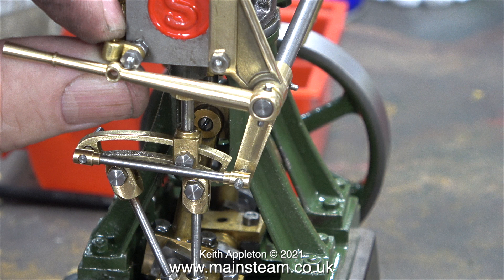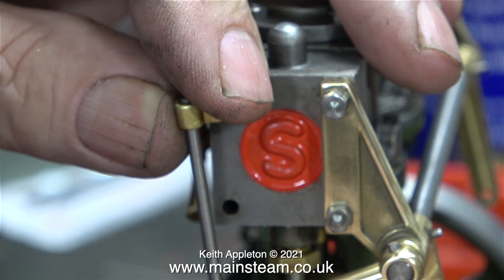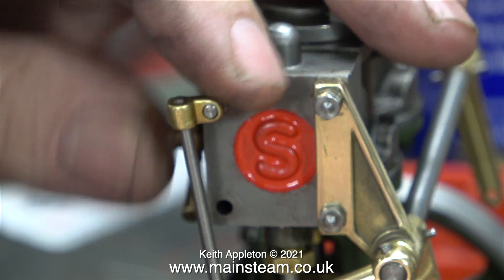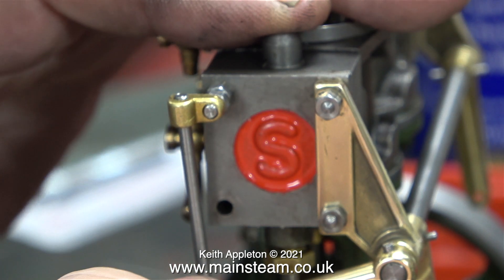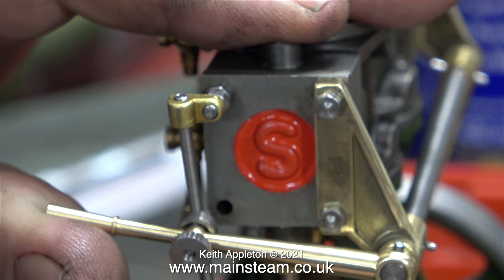I had a quick check of the dimensions and the position of the reversing bar. With it fitted to the bottom stud it didn't work. Fitted to the top stud it worked a little bit better, but the reversing bar wasn't long enough. To be perfectly honest I don't like the design where the locking rod is fitted to either the bottom or the top stud. I have an idea to rectify this problem — I think it will work and look much better too, and I'll feature that in the next episode.